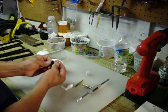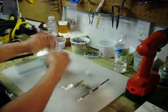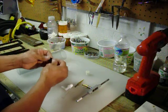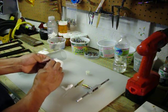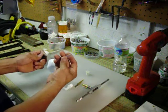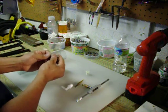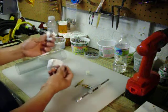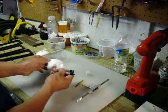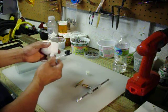You saw that little tube here. This is that high-density polyethylene tube that you use — it's a big coil of it in the back of your fridge. It looks like it's a mile long, but what it does is just put water in there and cool it, and when you want cold water, it's cold. A piece of that, and of course our standard quarter-inch tube that we use — just put it in here. I spot-tie these. This will be the fitting; I'll probably use a straight fitting. It'll slide in and you screw it in.